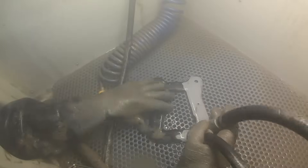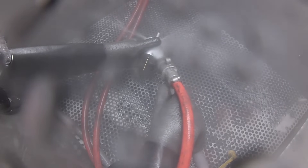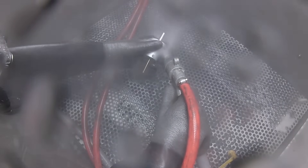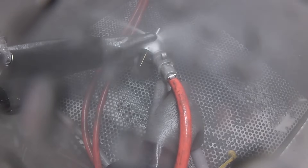Vapor Blasting combines water with the use of abrasive of your choice. Unlike in dry blast machines, you can even mix abrasives in the Vapor Blasting machines. The equipment then blasts these into the surface that you want to clean using compressed air. Your media is contained inside the vapor honing machine and is recycled to be used again and again. Because water acts as a cushion, the abrasive will last longer in the Vapor Blasting machine. As the particles hit whatever you want to remove, they break it up and wash it away — all you have to do is rinse the surface and the remaining debris will wash away.